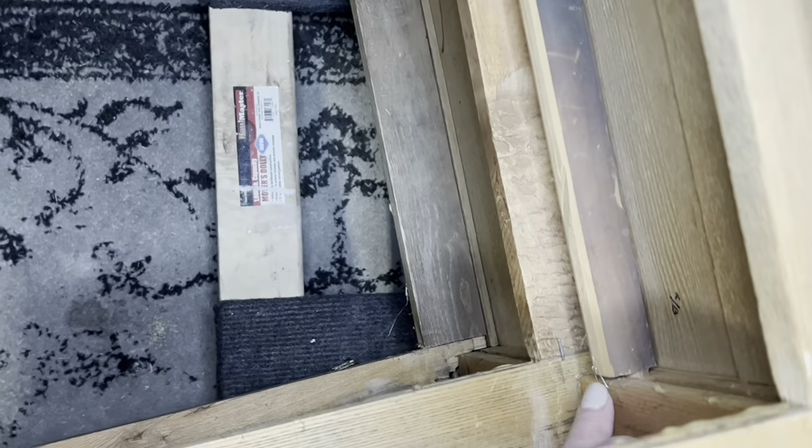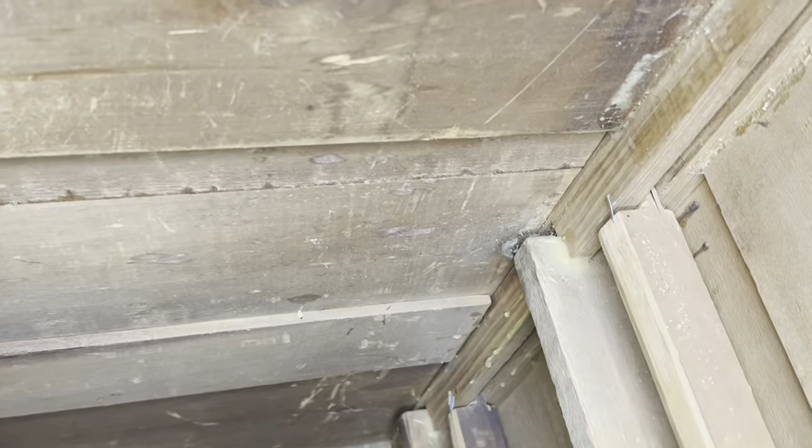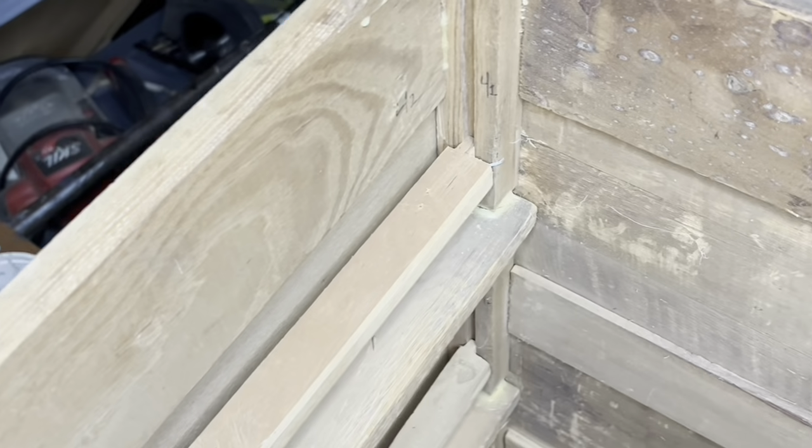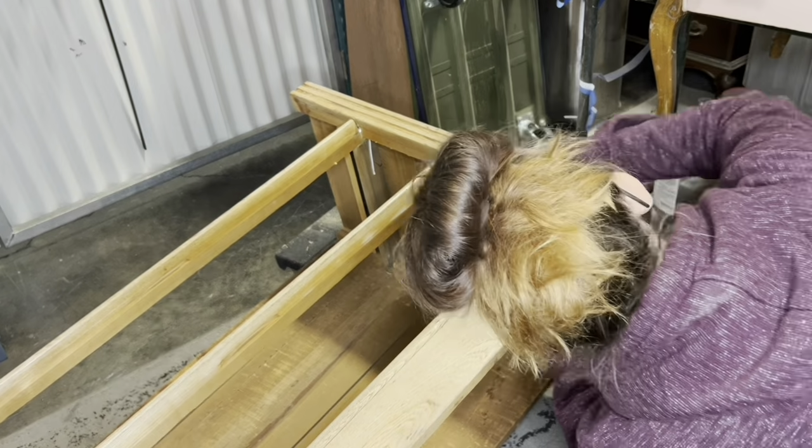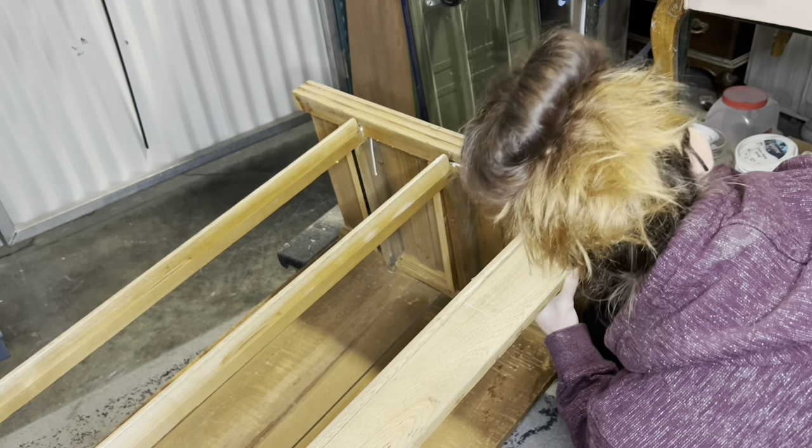And I kind of love when old pieces have just a billion repairs on them. And a lot of them are just random. Like there were lots of staples in here. I found bolts in the top, which wouldn't have been original. Tons of newer glue just from different joints and everything. So I have to go through and redo all of these joints because they were all loose.